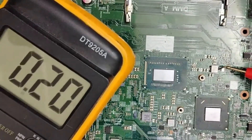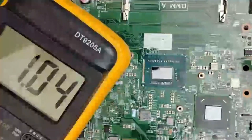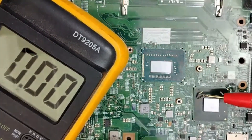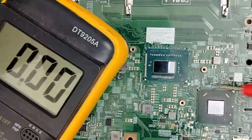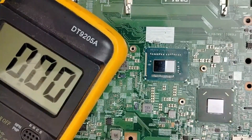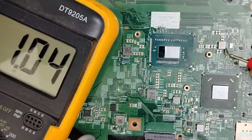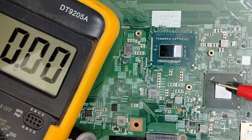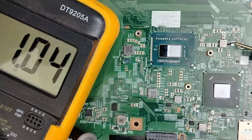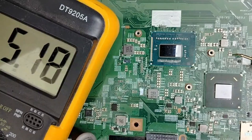This is a driver — it contains MOSFETs — and then we will get here 1.05 volts. 1.05 volts is for the buses here between the CPU and the PCH. So if there is no communication, if you get a motherboard with a data failure — no communication, black display — the reason could be that 1.05 volt here is missing. If 1.05 volt is missing, no communication between CPU and PCH, no display.